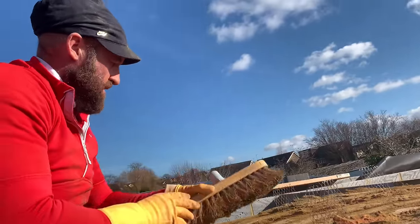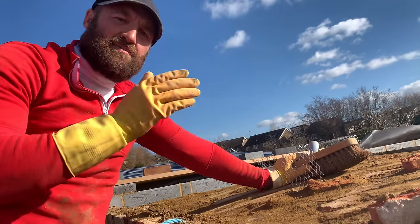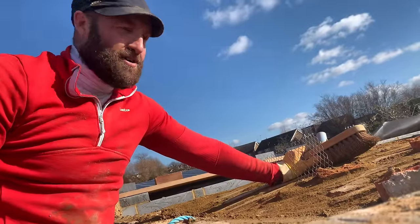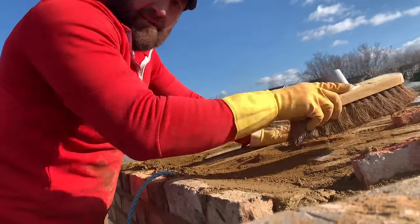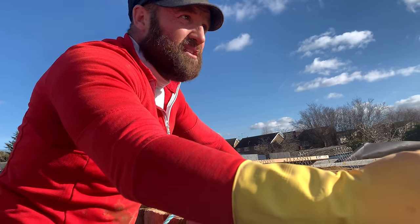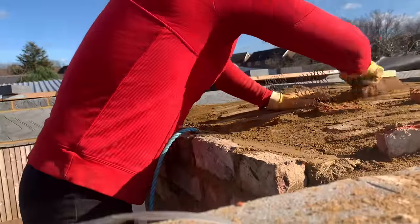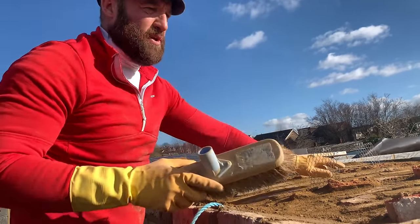Basically, arches should be worked out true to the opening. Depending on your opening size depends on the curve and the degree of the arch. I see some people doing opening sizes, they do a massive arch on it, it doesn't go. So structurally, that's wrong. If you ask a structural engineer or a building surveyor, they'll tell you. But obviously, a lot of you guys are on new builds. I saw a video the other day, arches and corbels. The geezers put a plastic template up and put an arch over the top of it. Is that an arch? I don't know. I'd call an arch where you see the guys do the formula itself, work out the degree and the gauge. That's more something like a quick fit.